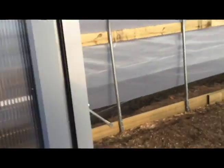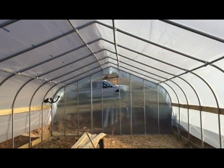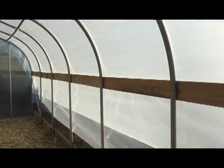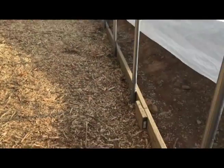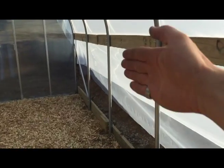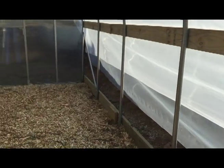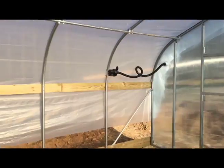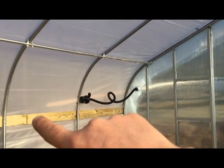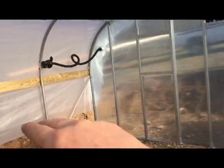This is inside looking south. We don't have plastic to the bottom yet — still open. There's a roll-up side that will be a curtain that comes down to the ground and then rolls up to allow venting through the bottom. So this plastic is only from this ledger board all the way around to this ledger board, and then there's a drop-down side on each side.